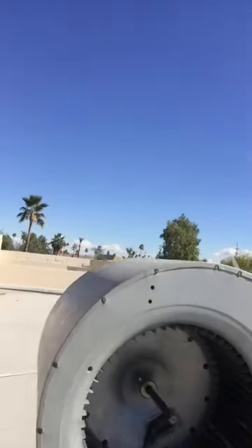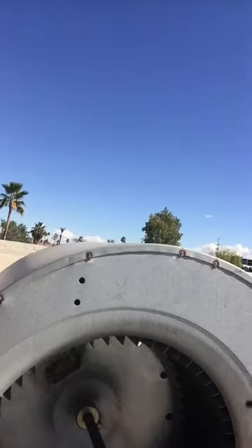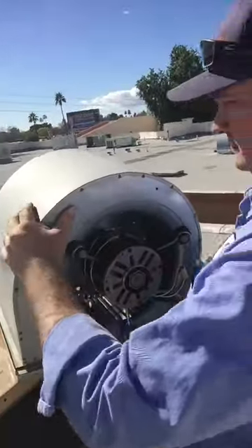We're going to cruise on this side. The shaft is through, the set screw is in place, everything has been free-spun. We're making sure that we've got our clearances. Now we're going to go ahead and install the indoor fan motor — it's already been tightened.